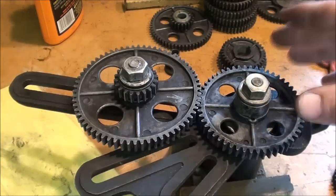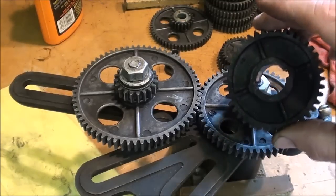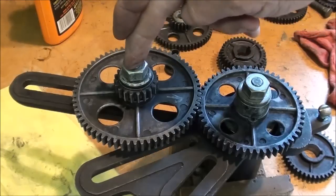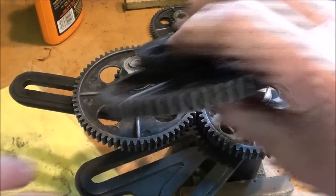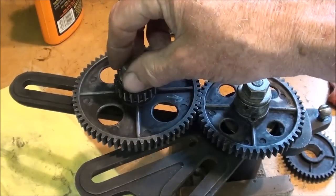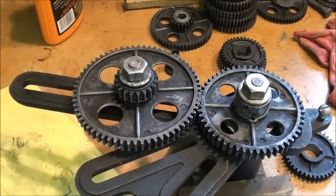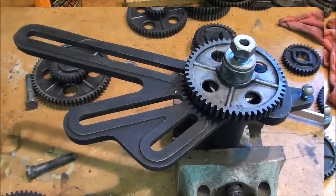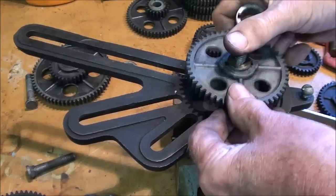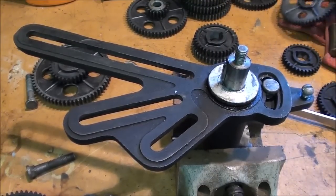Back at the bench. The first thing I'm going to do is change the screw gear from 52 to 40. In position A, right here, we're going to have a 64 and 32 combination. And then this one — which is a 20 and 64 — will be taken off and moved down to position C. So let me loosen these up and start to make the change. I've taken off the other gears, and the first thing is to replace the 52-tooth on the screw with the 40-tooth.